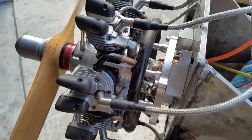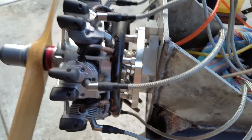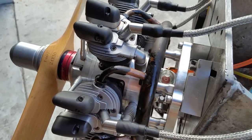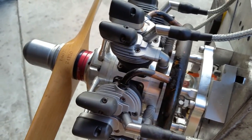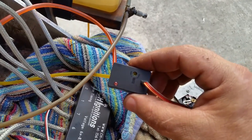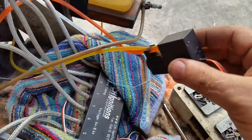The other thing this one needs is actually an electric pump. Radial engines, because of their configuration — even though this one has the enclosed plenum and a rotating fin which cancels pretty much the pulses that would help the carburetor pulse and pump the gas — because of that I'm using an RCXL smoke and gasoline pump.